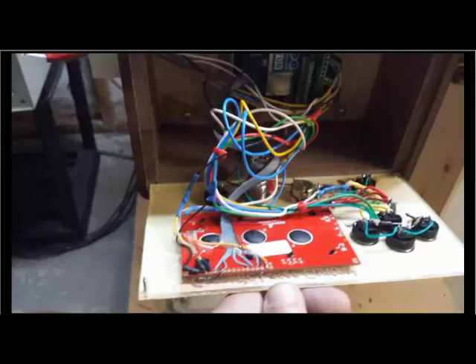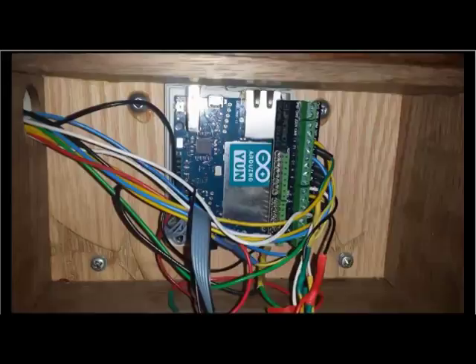This is the only wiring that you need to do for this project, and the worst part of it is probably the six solder connections to the LCD. Everything else coalesces down to about five or ten wires used on the Arduino UNO. You can see this ribbon cable coming in - it's six pins and it's just wired down and plugged directly into six pins on the Arduino. There's a little board worth about a dollar that plugs onto the strip and allows you to have screw terminals so you can screw all your wires on.